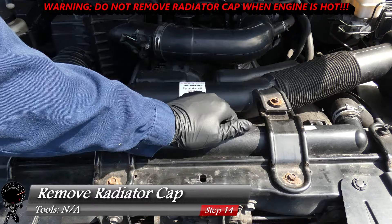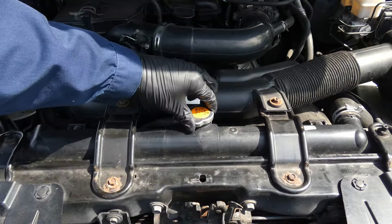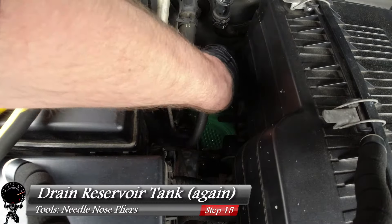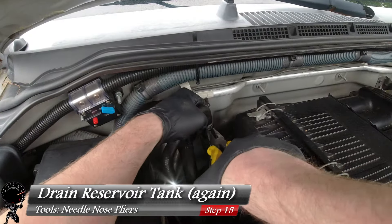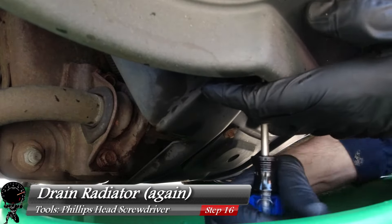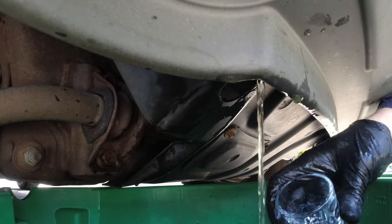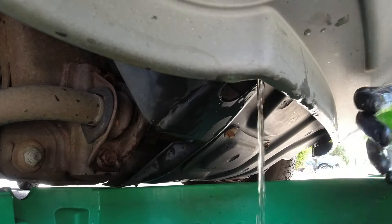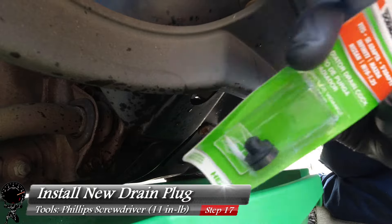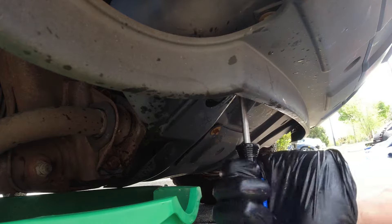After the engine is cooled down and the radiator cap is cool to the touch, we can go ahead and remove our radiator cap. Now let's drain our reservoir one more time using the same process as earlier, reconnect our bypass hose, move the drain pan right back to the radiator, and remove the radiator drain plug one more time. If you look at the coolant, it looks pretty clear — that's a good sign. After about 20 minutes, we install our new drain plug. The old one looks in good shape, but we did buy a new one for the washer — that's the part you're supposed to change out. Finger-tighten it, then tighten down. It's supposed to be tightened at 11 inch-pounds, but we're going to do this by hand until it's snug.